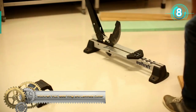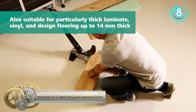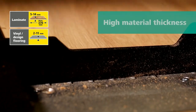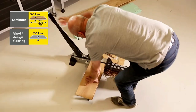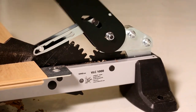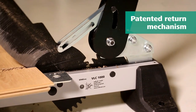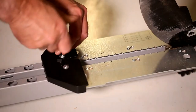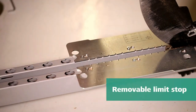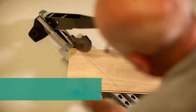Wolf Crafts VLC-1000 Vinyl and Laminate Cutter. This is a high-quality, powerful vinyl and laminate cutter for professional use. Its gear unit with three-fold power transmission makes it easy to cut thick laminate, vinyl, and design boards with a material thickness of up to 14 millimeters and a width of 370 millimeters. The patented return mechanism moves the blade back to its original position after the cut, optimizing work progress.